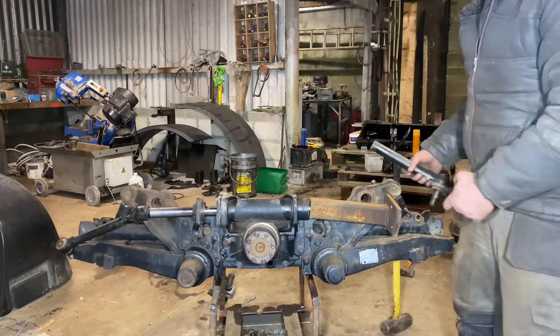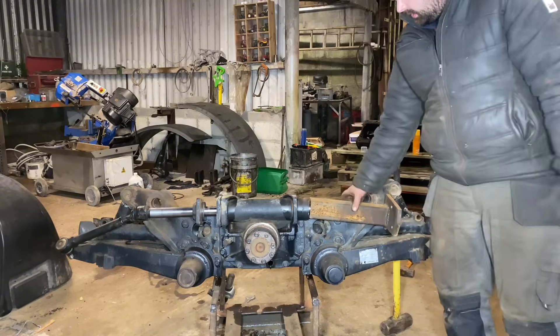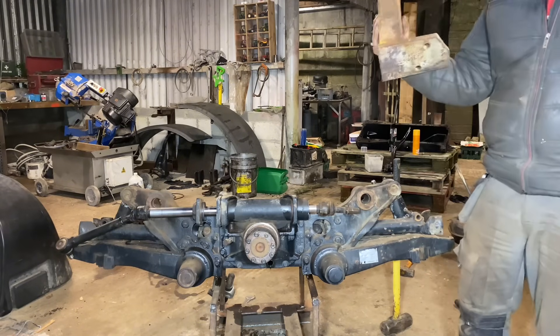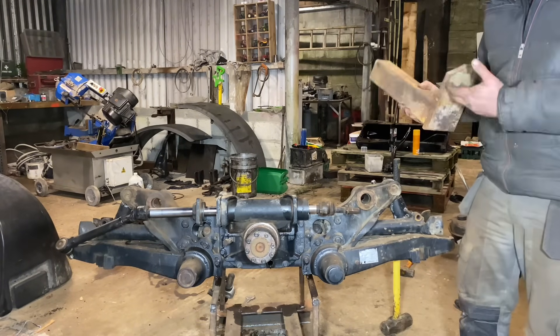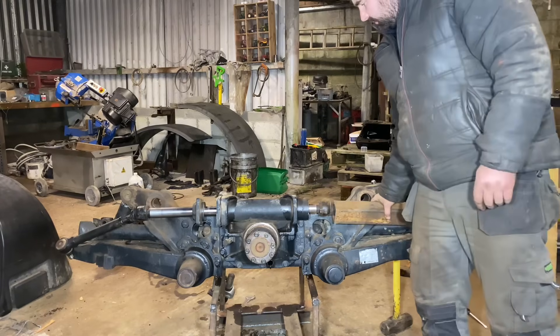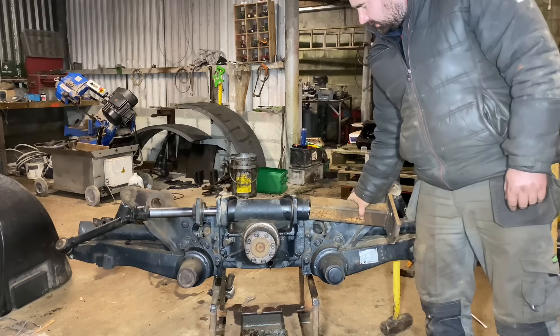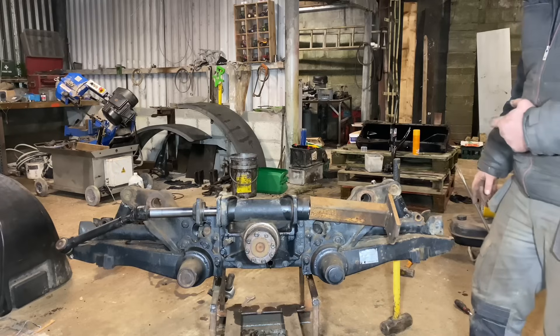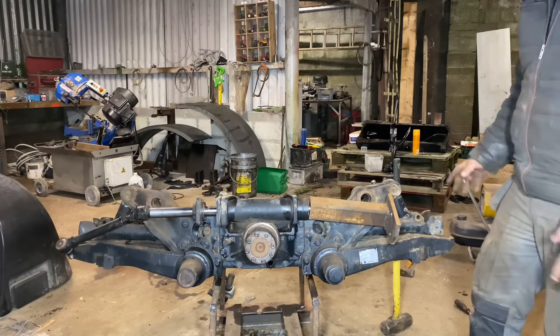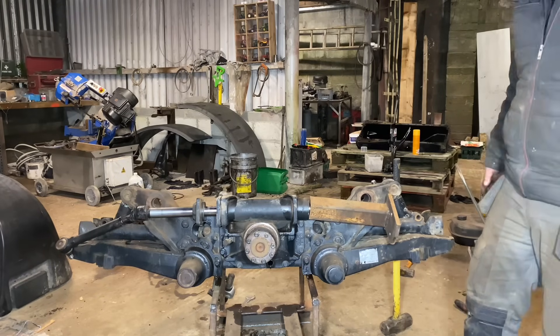As you can see, there was a bit of box iron with a plate on there. For what purpose I don't know, but it's handy to keep bits of steel like that whenever you need them. So basically what I'm doing is I'm standing behind it there, beating that to get the ram across and the ram will come out.